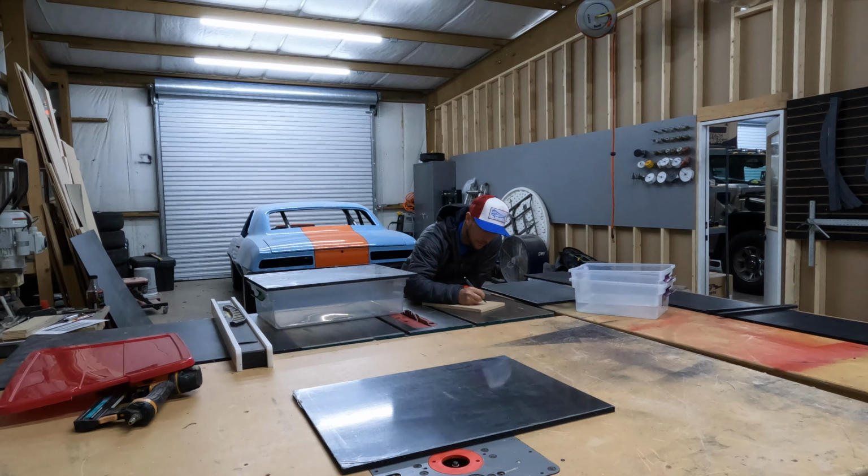So there's what the full dado is going to look like on it right there. And if I was smart and had my other blade in here, I would rip something and put a stop on this side and put a stop on this side. That way I could slide it over there and know exactly how far to run it through. But whatever, I don't have that.